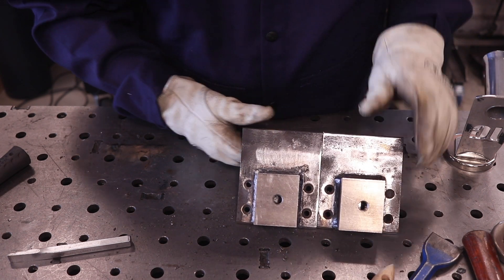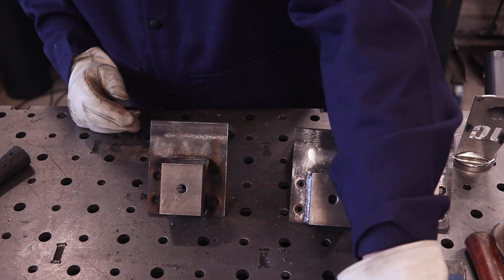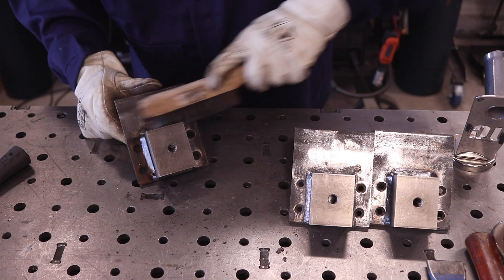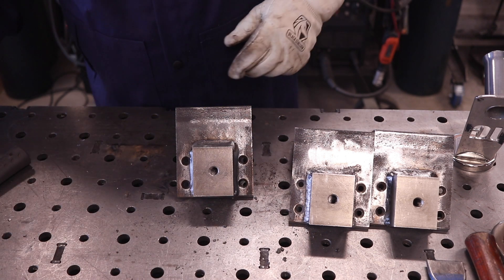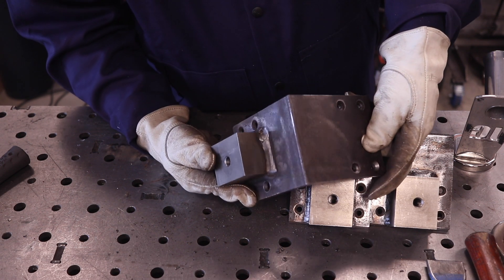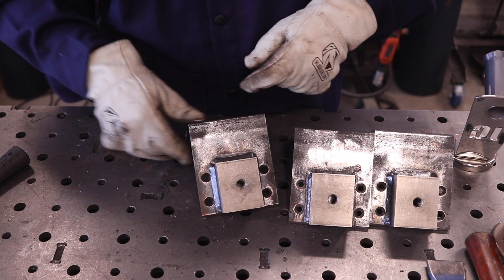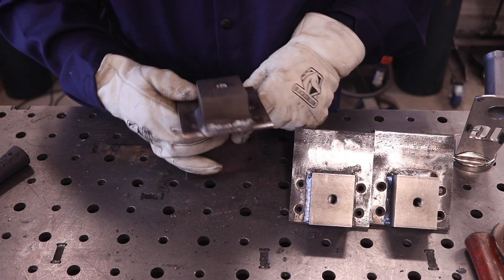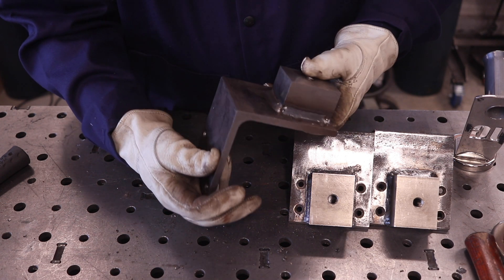Now for the spray arc MIG — really not much to do here, just a quick wire brush to clean it up. That weld went in really smooth, nice and fluid, looks good. Zero spatter — just one tiny speck I can probably deal with. It was fast, it was clean, and we're well within the parameters of the countersink holes. It's going to be plenty strong.